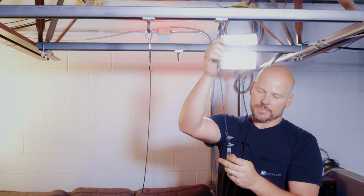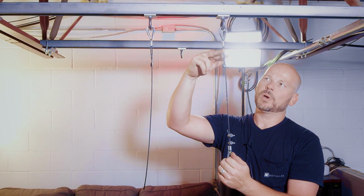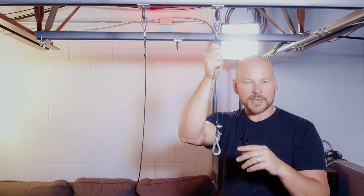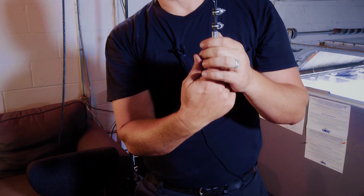The top is the same, okay? Wire rope, thimble, ferrule. And then earlier you saw me put 1 Crosby on. The 1 Crosby is really specific to, you're just trying to hold it all in place while you're working on it. If you're gonna add a load to it, meaning I wanna actually hook this speaker to this wire right now, before I swedge this, then I would do that with a double Crosby, because I wanna make sure that if I'm gonna add a load to this, that there's no chance of something failing and that load falling and hitting the ground.